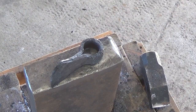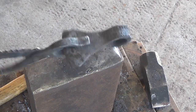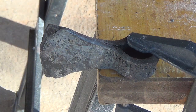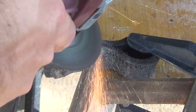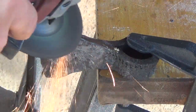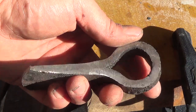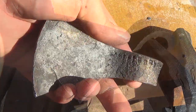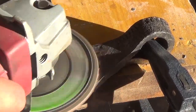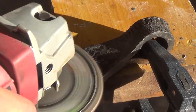Here's the head after forging. I just let it cool and then we can start grinding. Now that it's cooled, I use my angle grinder to grind the profile of the axe head — grinding the top, the bottom, and the edge. With the flap sanding wheel, I grind off all of the scale and bring it down to a nice finish so that it's ready for heat treating.